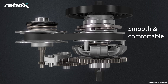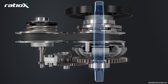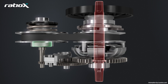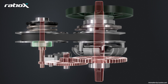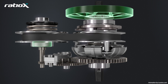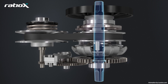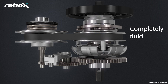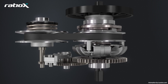The result? A smooth and comfortable riding experience. The system adapts the transmission ratio even after the rider stops pedaling. When the pedaling is stopped, a free wheel is engaged and the system is decoupled from the pedals. The correct operating settings are maintained, with the system remaining in sync with the bicycle speed. Once the pedals are actioned again, the optimal transmission ratio and therefore pedal speed is already selected without effort — a completely fluid transition, without lag, at every speed change, every time.